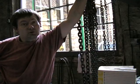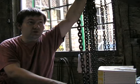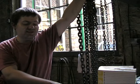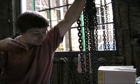But I think what must have happened was, if we were sent just a blank fourth that had been tuned to your tenor, nominal, we'd have assumed that the existing five would have been stretched a bit and carried on from there. But your existing five are actually compressed rather than stretched, so there's a big gap between three and four. So that's why you've ended up with a big gap between three and four.